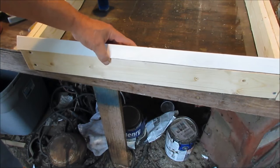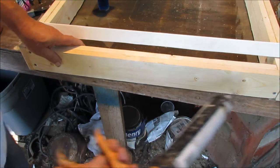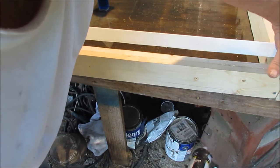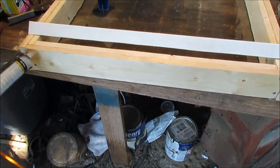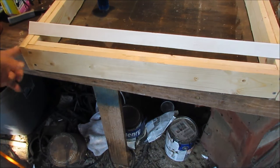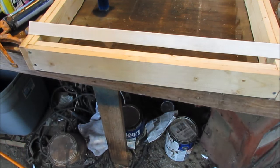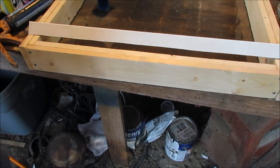Alright, this is the body, and we're going to be putting this piece of metal right here. But before I put that piece of metal, I'm going to go to these corners right here and wipe some silicone in them. The corners of the skylights is what's bad about leaking. I've done a bunch of them, and just because you buy a brand new one from the factory doesn't mean it's good — those are the ones I've been called back to fix.